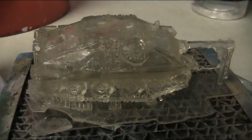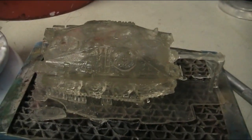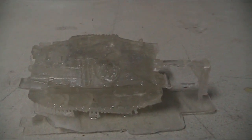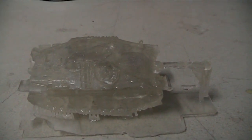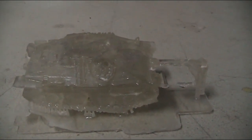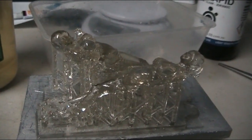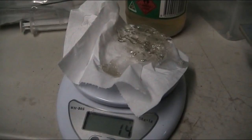The tank warped a little bit, but it actually came out absolutely ideal — being hollow and lighter, it is mechanically pretty sound. Unlike the figure, this has over a hundred supports, a lot of them very sturdy. Once you wash it in methylated spirits — or for everywhere else in the world, isopropyl alcohol — and water, it has a tendency to fog up a bit. You can use special mixer chemicals to keep it crystal clear as if it just came out of the vat. But frosting up is good as you can finally see the details. Even though some of the supports did not survive, this print is a total success. The clear resin does work but is more troublesome than the white. After 13 seconds we finally have the perfect print with no fault, though there was a little over-exposure in a layer of material on top — just the drawback of this material. Almost a dollar in wasted resin — not happy at all.